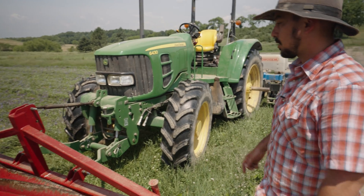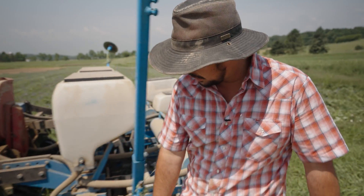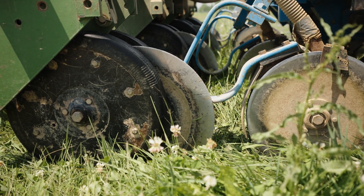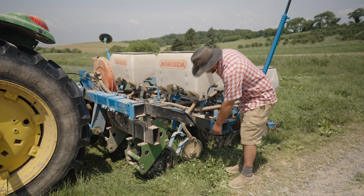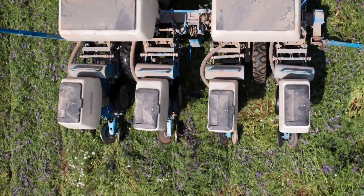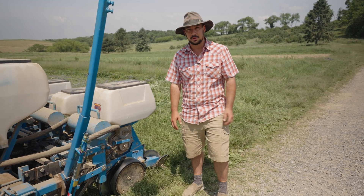So that's the roller crimper. Let's go to the back and talk about our planter. This is a pretty typical corn planter; the only addition is on the front here we see these extra gangs of cutters. These black wheels hold the mulch in place, and right in between them there's a cutting disc. That slices right through the mulch, then it goes back to another wavy coulter that opens up the trench a little more, and then we have a double disc system that opens it even more — and right in the middle of that double disc system is where we're dropping the corn.